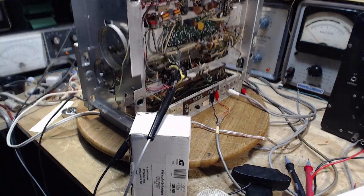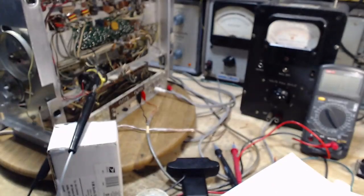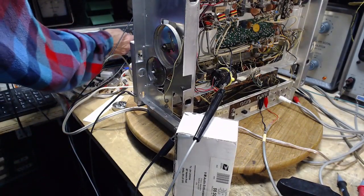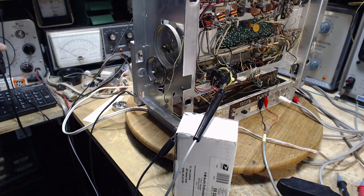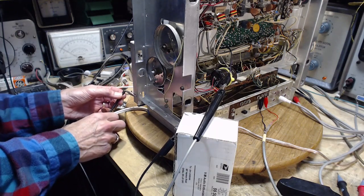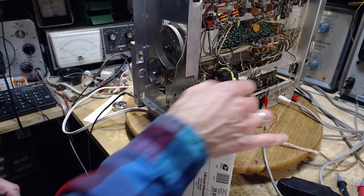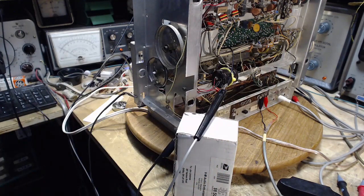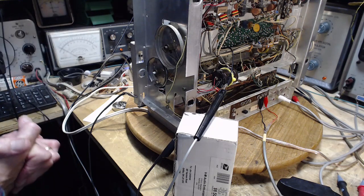Now we've got other issues here, like the signal level. It's sitting there. Is that an issue? Okay, the voltage we're getting. Something funny is going on with this. Is my ground wire breaking here? Ground is on. Here's on DC. Test point is on. 19 kilohertz is on. No voltage is on.